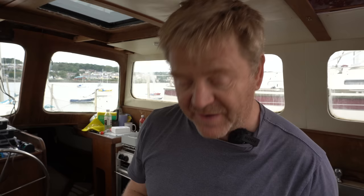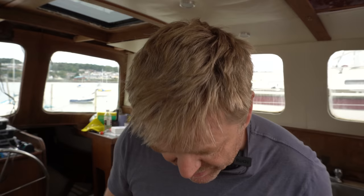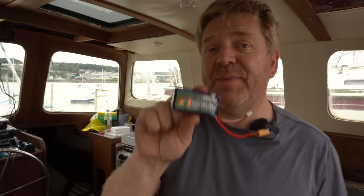And it then means that I can literally turn the whole boat off if there's an electrical storm, isolators off, batteries off, everything off, and I can just run individual batteries like this, lithium batteries or any battery with the right voltage, to port light, starboard light, stern light, VHF. And everything's got its individual little battery, you know, even if you just gaffer tape it to the back. But it means you can switch everything off but still have nav lights and comms. I might do that, but probably not today.